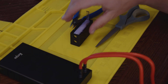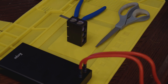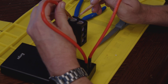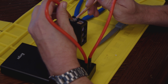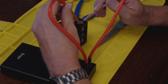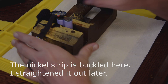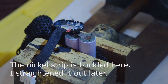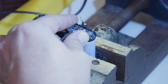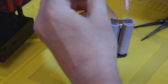Okay, back to the project. It's time to spot weld. This is a very inexpensive spot welder I got from Amazon — I'll link it in the video description. It's simple, with 6 levels of power output. I'm using level 4 for welding the strip to the battery, and this jig is something I 3D printed from plans on Thingiverse. You don't need a jig — a clamp or even just taping the cells together works fine. The cells are oriented in parallel configuration, again just like the factory. Now let's reattach the BMS to the positive end of the two-cell battery pack. I use a table vise for a third hand while I heat the solder on the BMS while pushing down gently, and it slides in. Get it snug and reflow the solder. I left the negative wire soldered to the factory nickel strip and will spot weld it to the middle of the strips I put on the cells.